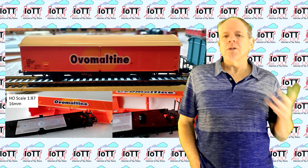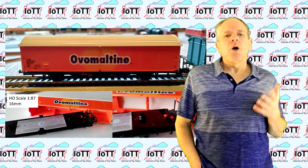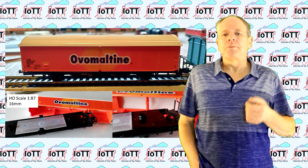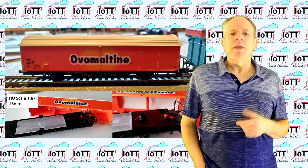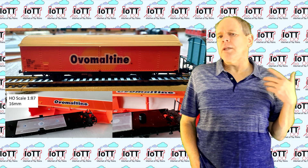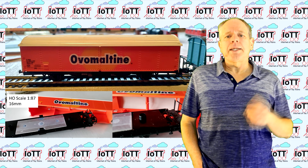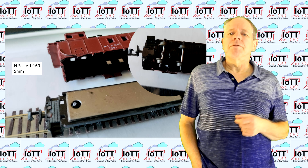Unfortunately, real cars do not always meet these ideal characteristics. Here are some pictures of the HO-scale car I selected for my tests. As you can see, there are some plastic domes sticking out from the floor which are used to screw down the axle holders underneath the car, so it is not possible to cut them away. As a result, it is only possible to either install the sensor with some additional distance to the magnet or with an offset to the axis of the magnetic field. In the case of the N-scale car I'm using, it is even worse.